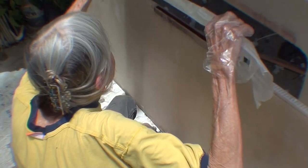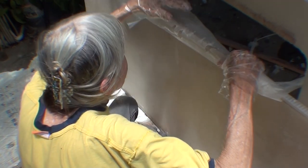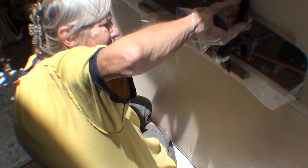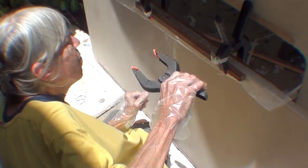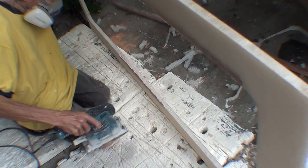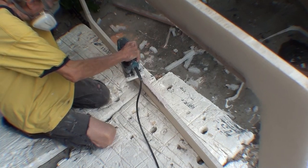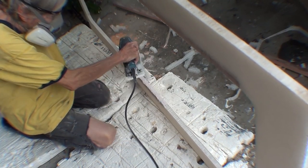The inlays are just a little bit shy of the top. They're recessed by just a very little bit, so once this resin hardens, I'm going to put some fairing compound over all of these, and see, it's in place there. And like every step with fiberglassing, it's followed by sanding.